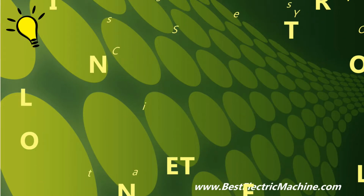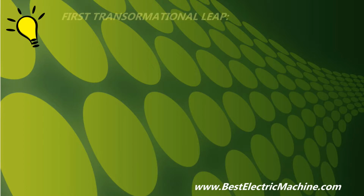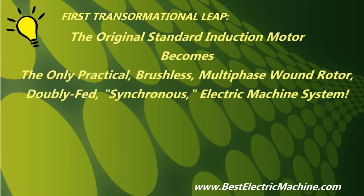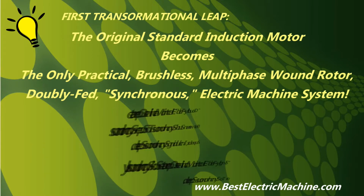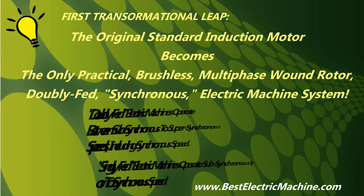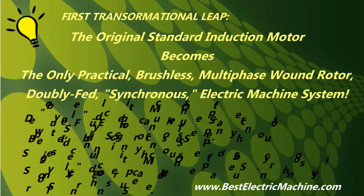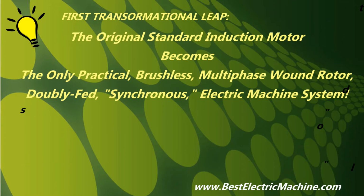First transformational leap, the new retrofitted electric motor system becomes the only practical, brushless, multi-phase wound-rotor, doubly-fed, synchronous electric machine system that contiguously provides symmetrically stable motoring and generating operation from subsynchronous to supersynchronous speeds, including about the unstable synchronous speed and zero regions. Note, practical operation of all other electric motors is only from subsynchronous to synchronous speed because of conventional state-of-art control instability, such as any derivative of field-oriented control.